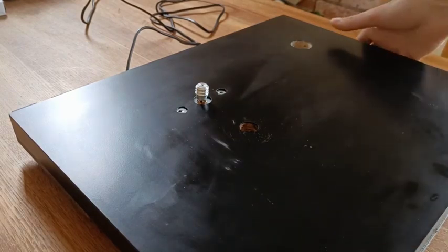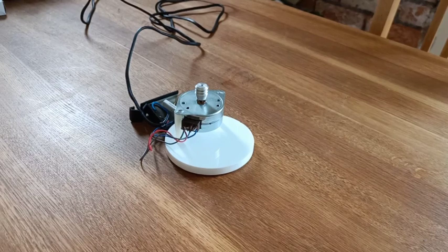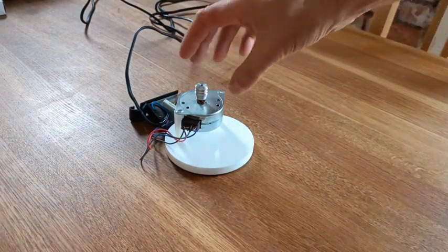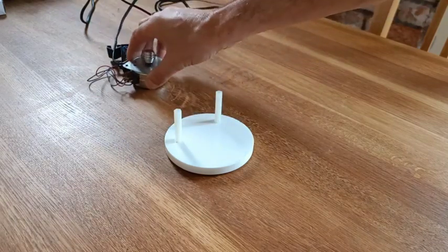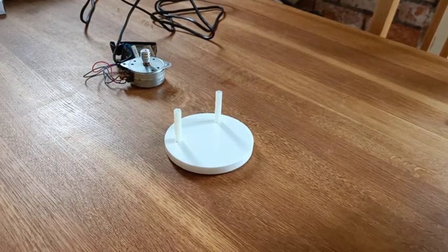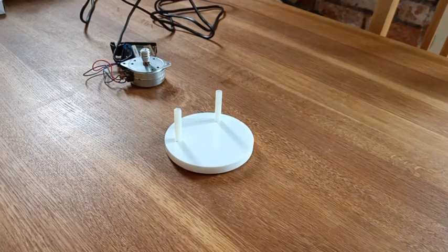So if we lift off the plinth, the deck — carefully because I don't want to knock the motor — this is the motor mount I had set up, which I don't think I've really showed properly previously. The motor would have been held down by two screws, but I used 4mm plastic nylon screws with a pan head. Those then attached into these rods, which I think are either 35mm or 40mm — I think these are the 40mm variants. I just tried different rod heights until I found one that worked quite well, and then I adjusted the whole plinth up and down to match.